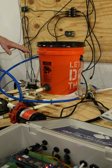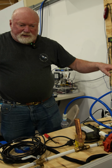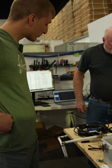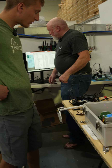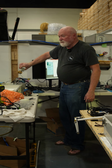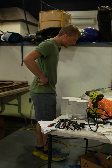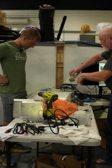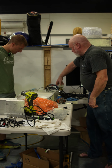The diverter valve flushes the water made for the first 1 or 2 minutes to get rid of any salt or TDS, right? And then it switches over to your main tank output. So it's automatic. It automatically diverts the first 2 minutes worth of water, and then it shuts and goes to the tank. And if it loses power, it goes back to non-tank output as default.